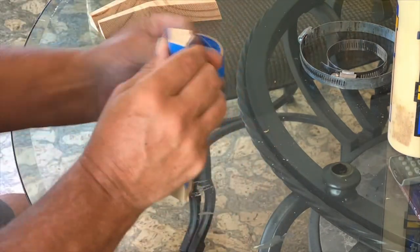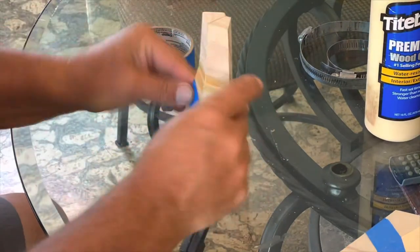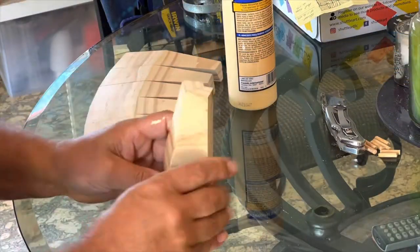The five degree cut laid flat on the table of the saw, plus the two five degrees glued together to make the compound board, equals the 15 degree cut, so that the final splayed pieces actually sit flat and the top and the bottom are parallel. As you can see here, the pieces fit together nicely and sit quite flat.